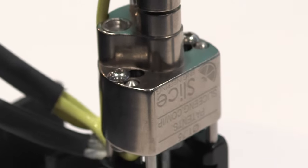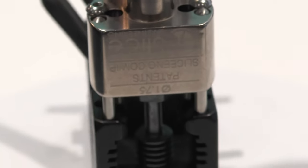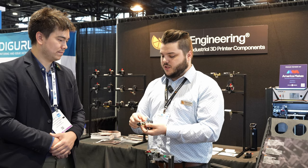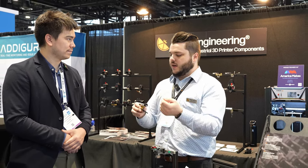It's got a really long melt zone, nearly twice as long as Magnum Plus at 61 millimeters. It's got up to 150 watts of heating power, three temperature sensors because you've got dual melt zones. But then all the standard benefits of the Mosquito hotend: one-handed nozzle changes, bimetallic heat break, and the rigid construction.